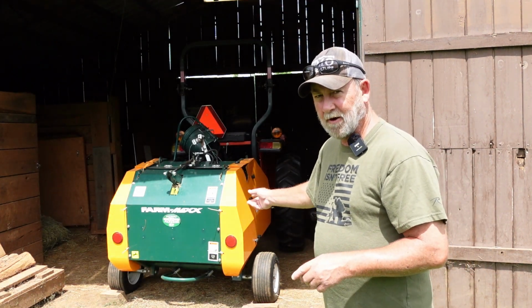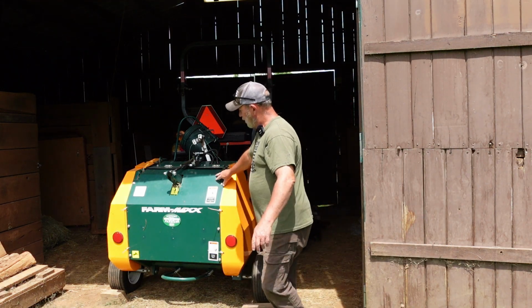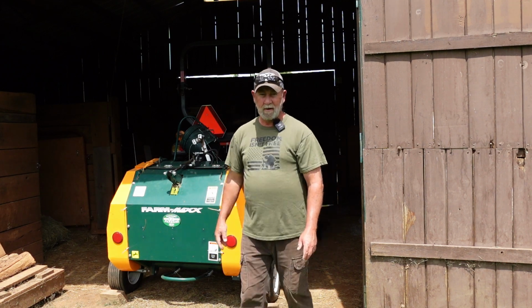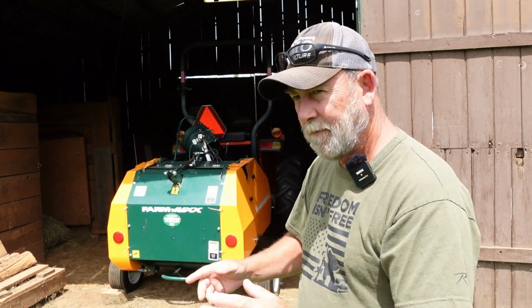There's an area on this baler, if you haven't saw our other video, about how hay gets so trapped between the rollers and this skin on the back door. It just gets packed in there. I mean compacted. With those rollers turning, say my hand here's the skin or the sheet metal on the outside, and the rollers here turning, hay will get up in between those on some bars. There's some structural support bars for that baler on the frame of it that runs through there. That hay will get in behind those bars and the rollers and that skin and just pack in there.